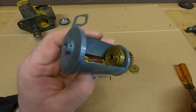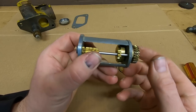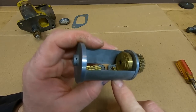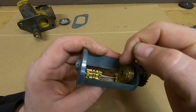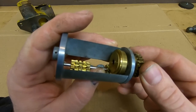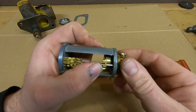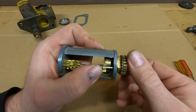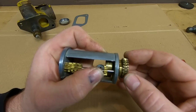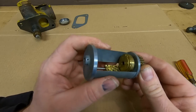The reason for the wide and narrow has to do with these two teeth on the drive hub. Those teeth only ever engage with the wide teeth on the pinions. The narrow teeth just float up against the face of the hub, and the narrow teeth are the ones that engage the next disc or dial on down the line. As this turns around, that tooth section advances the pinion one wide tooth every revolution. You can see it caught a wide tooth, turned it, and now a narrow tooth is just up against the face — not being turned until those teeth come back around and engage the next wide tooth. That's the clicking action and how you transfer rotation on down the line.